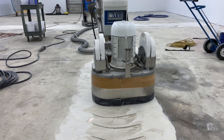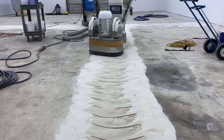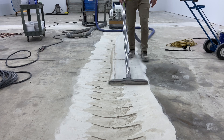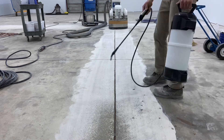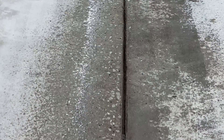The main aim is to flatten any elevation inequalities so that the coating will look better and wear better. In just under two hours, 60 linear feet of joint has been flattened — though not all of the joint had exactly the same elevation inequality. Overall, the joint is more flat, which is going to help the new coating that's going to be installed next.